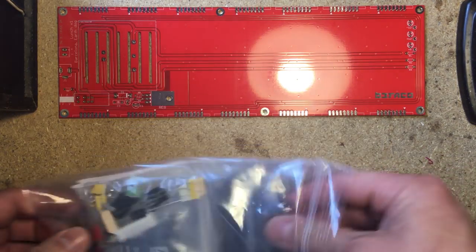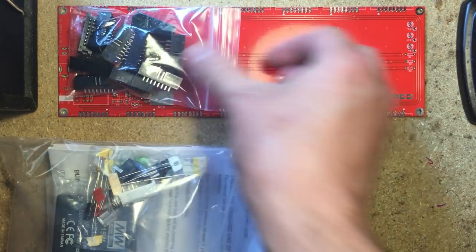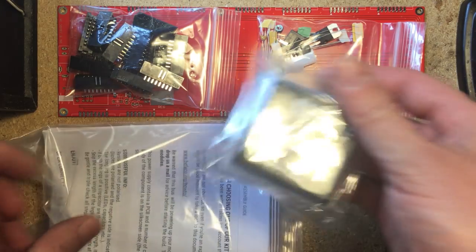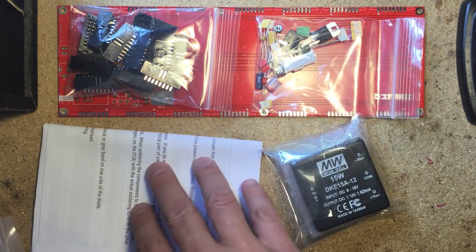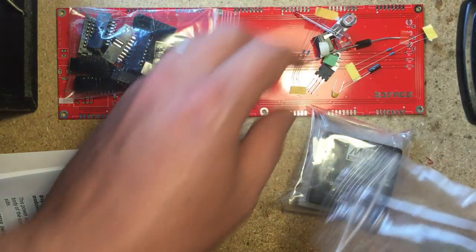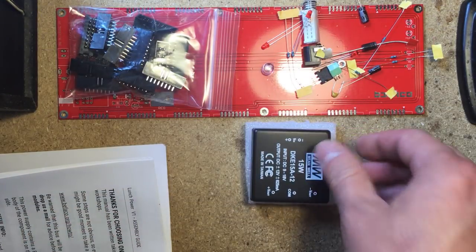The kit for the Lunch Power comes with everything you need. There's a single PCB which is both the PSU and the Busboard. You also get the required components, like the 5-volt regulator, some diodes, resistors and LEDs, 14 boxed power headers, the power switch, a jack for an external switching wall wart, and the Meanwell 15-watt DC-DC converter. You also get a printed build guide.